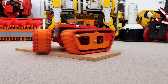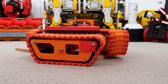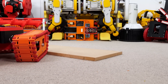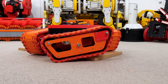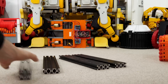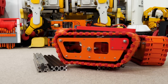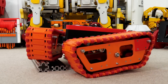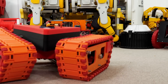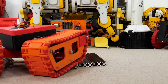I'm going to do that a few more times for practice before we try some other obstacles. Those pivots are really helping to make the tracks comply with the surface — I'm sure it would probably still work without them although we might get grounded, so I'm pretty happy we've got that feature. I've got various aluminium extrusion to try here — some 20×60 and some 40×40. Again there's no problem driving up with those two treads, but the back one is going to get stuck unless I try to rotate onto it. Once I've rotated onto it there's no problem climbing over — it's just tricky to remember which way round I am.